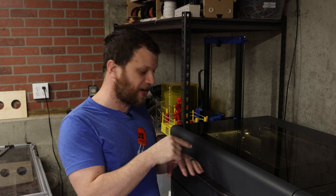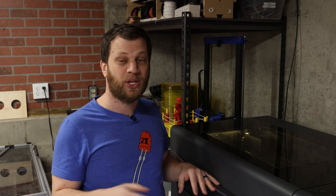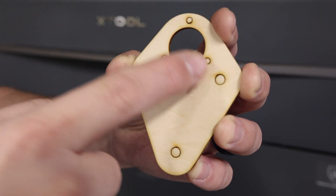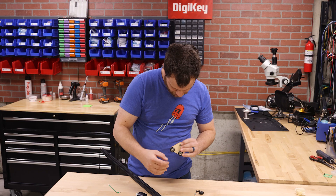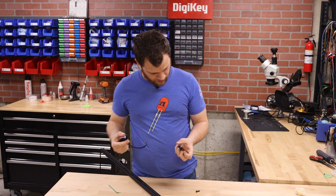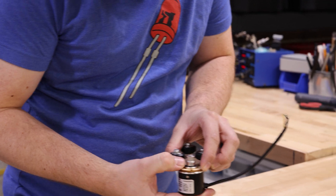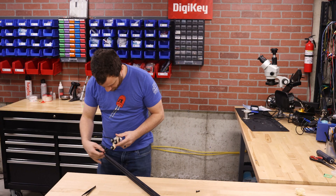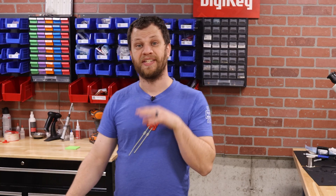I'm a big fan of the X-Tool laser cutter — they sent me this machine a while back and it's a real workhorse I use multiple times a week. I've got the hole up top for the rotary encoder and three holes for the V-wheels. The spacer goes on next, then the V-wheel. Now that I've got the V-wheels on I can fit the encoder — the holes lined up perfectly. Let's see if I got the spacing correct on the extrusion. Perfect — that works awesome, so now I can continue this design.